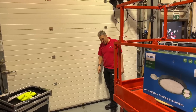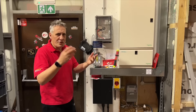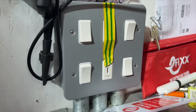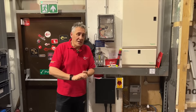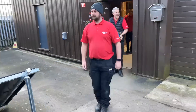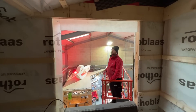There's the first problem - mud on the newly painted floor. Looking at our existing installation, we've got two really old discharge fixtures that we never use because of their re-strike and warm-up time and awful light - so much so we've taped the switch off. The other two fittings are LED from the Gen 4 range. You might wonder why we're changing them, but they don't have sensors, and the big problem is everyone forgets to switch the lights off, so we want to save energy.